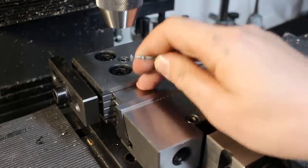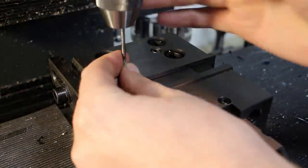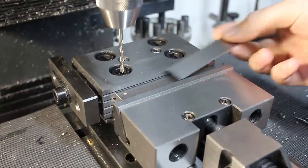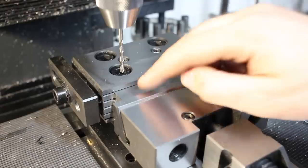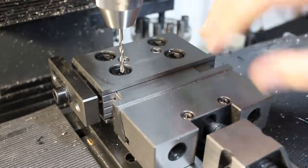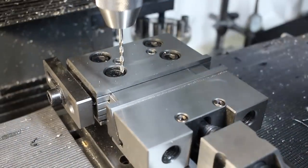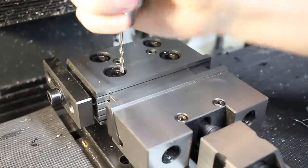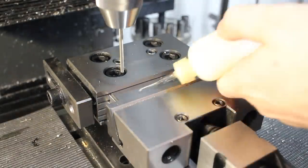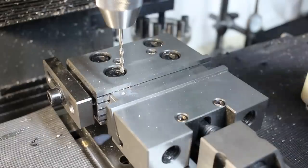Then you need to drill something like this spring steel. Let's see what happens if we try to drill this normally. I have a drill in a drill chuck and a piece of cold roll below the spring steel as a sacrificial piece — that's better than wood. If you don't do that, you push all the material down and it gets wonky. Let's give it 1000 RPM — that's relatively slow for a 3mm drill, but theoretically it should drill okay. No, it doesn't.